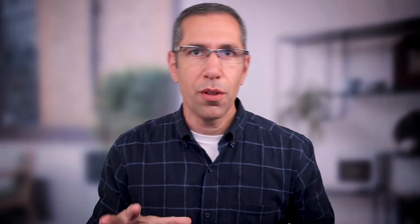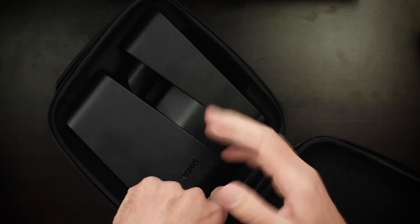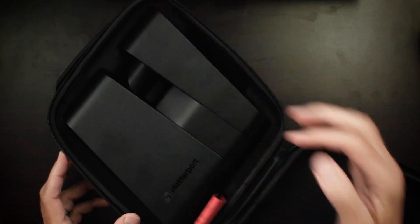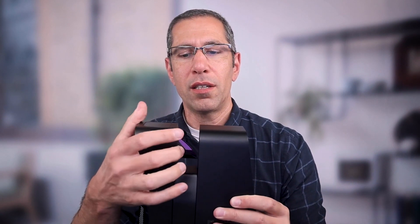Before I go ahead and pop this on the tripod, of course, can't forget the camera itself. The camera does fit really nice and snug into the case it comes with. There is a handle at the top and it comes with a little strap that you can pull to pop the camera out of the case. You have a mirror right here that's pretty sensitive — you don't want to touch that — and a lens right here that we don't want to get fingerprints on. As you can see in the front, we've got a massive lens with a super large RGB sensor for spectacular image quality. Right here you've got your LiDAR mirror, which will spin around to get the high-definition point cloud. And in the back, you've got the battery status, Wi-Fi connectivity, and the power button right here. The battery goes in the bottom, and the quick-release clamp goes right here.